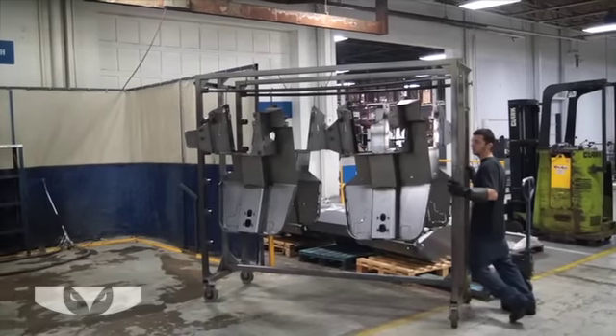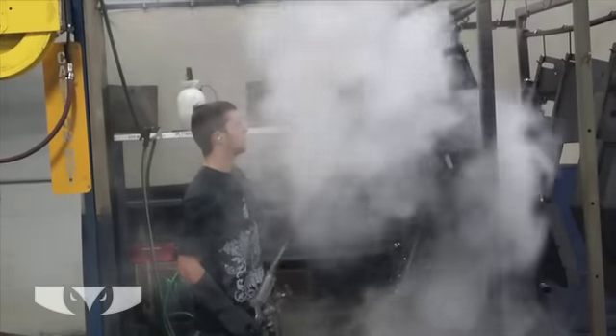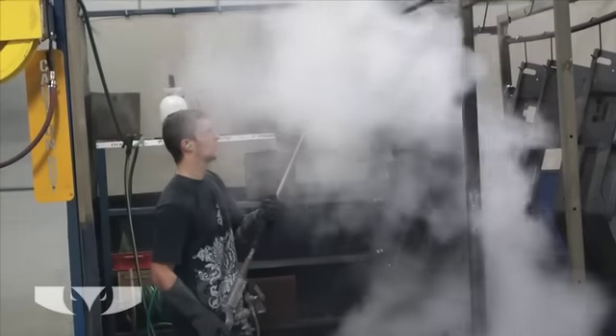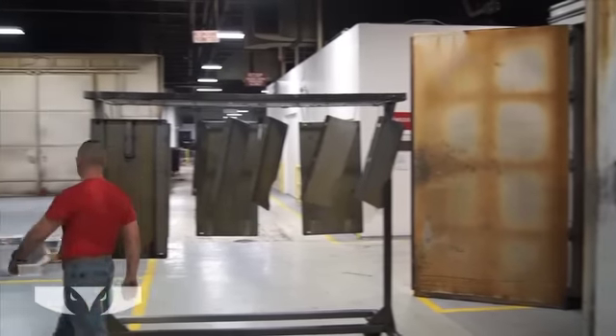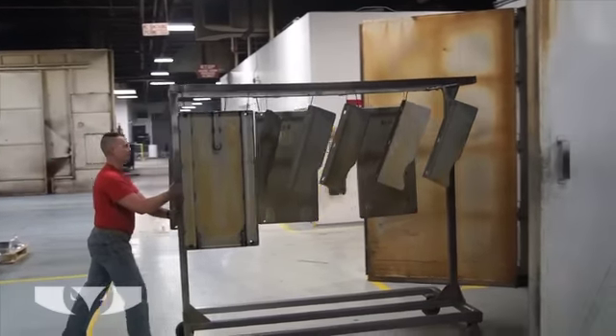During this painting process, the steel is first thoroughly cleaned to remove any dust, debris, or other buildup. The parts are then put into a very large oven to be dried. We put a negative charge on the parts using an electrode.